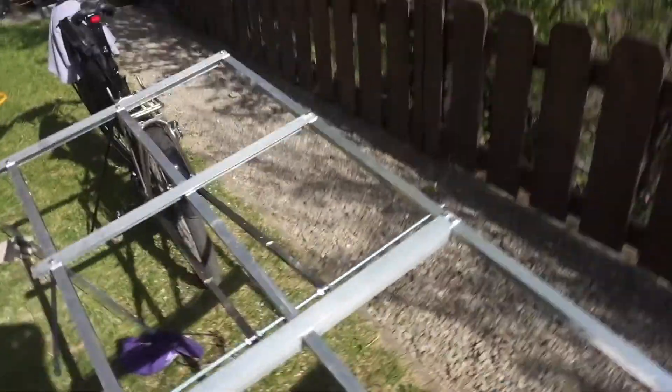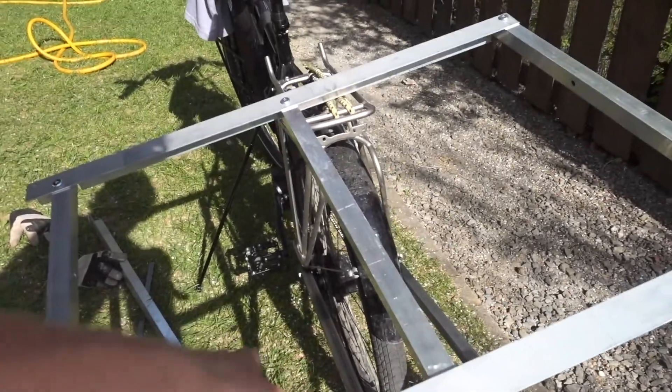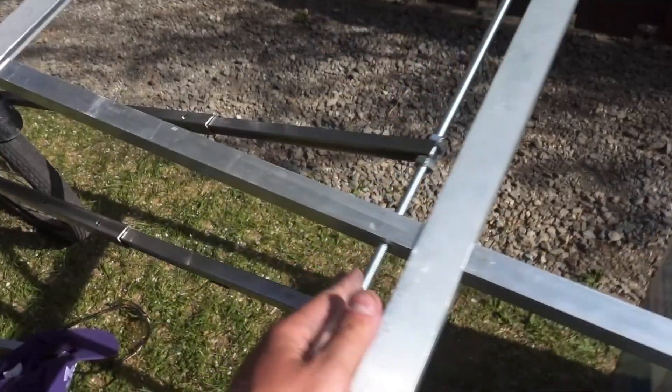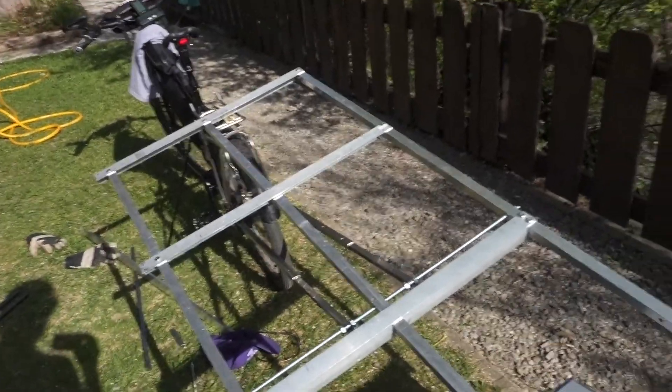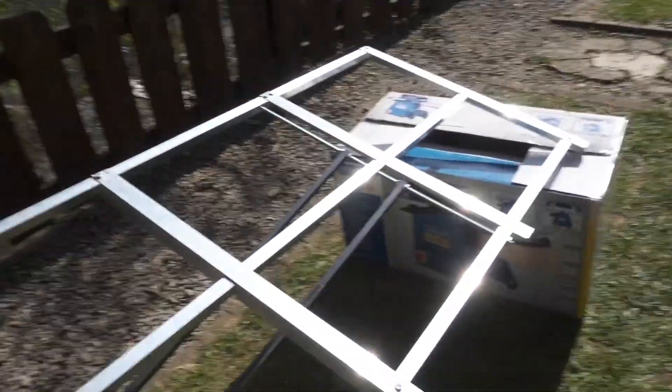Update — it's another day. I managed to get some more materials and made a few improvements to stiffen up the structure. I've put one in the middle which makes a big difference, and also supports the panel so it's not bowing over time with vibration. I've upsized from M8 to M10, so it's a lot stiffer, and I've moved it from its old position to near the beam. With this central part it's very rigid now — not a lot of play, which is really good. Obviously I've added a bit of weight but I'm very happy with it. Next I'm going to try and re-engineer the seat post lock mount.